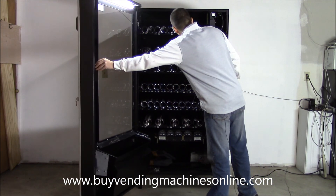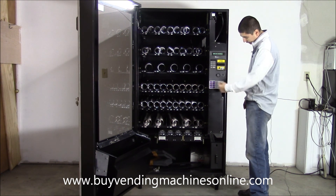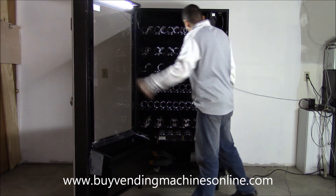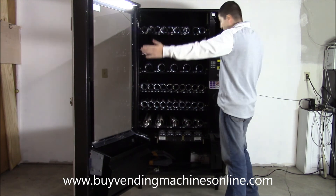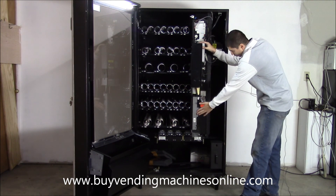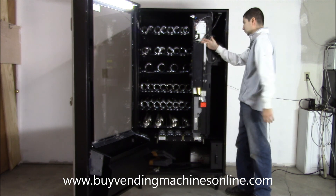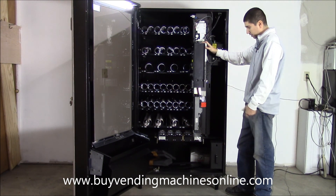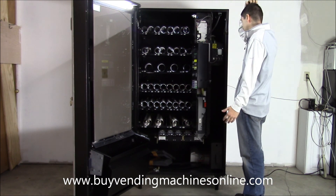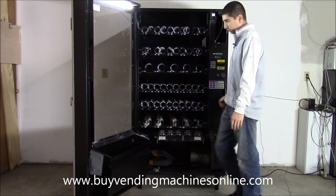Opening up the machine, it's a basic snack machine. Below the keypad on the inside, hidden from the outside, are all the configuration settings for the board. There's an instruction panel on the inside of the machine — if you need to change prices, you reference the numbers here. Folding this open gives you access to your coin mech and bill acceptor. We've got a Mars VN4000 four-tube coin mech and a Mars 2000 five-dollar bill acceptor. We can install Coinco, Mars, or Conlux depending on what the customer wants. Here's the board for the machine — it's a very reliable machine.